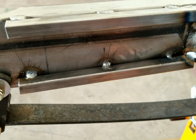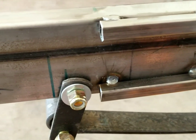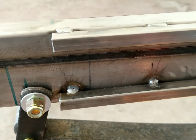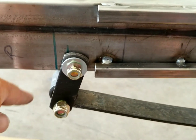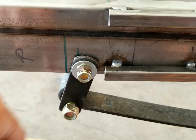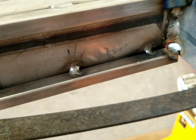I got the spacers welded on both sides — they worked out to be about seven inches long, giving plenty of clearance for the spring shackle. Once the spring goes through its motion, it will not hit the floor. The floor will have to be notched a little bit at the front to provide a clearance area for the spring shackle and bolt to travel up and down without interfering. Now it's time to start cutting some aluminum.